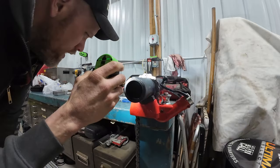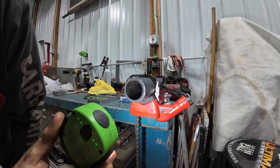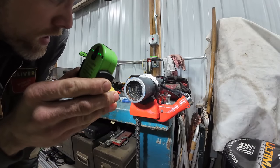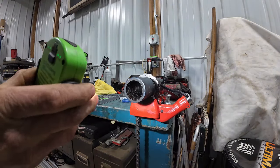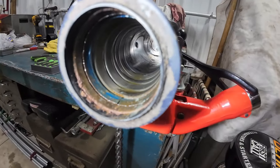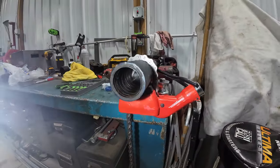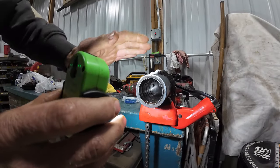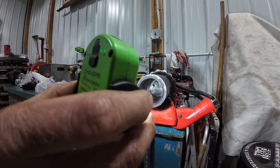I'm going to take out the two seals — I already checked the bore and it looked good. I'll double check it once I have the seals out of the way and we'll go from there. You can kind of see inside here and the seals are at the end. The reason this doesn't come apart is it is restricted by the travel of the three-point and a pin on each end, so it doesn't allow it to come apart.